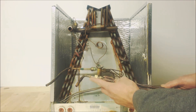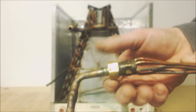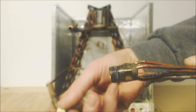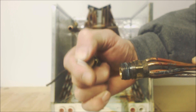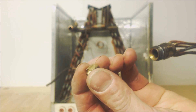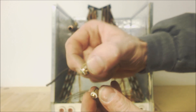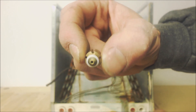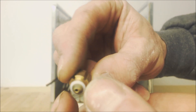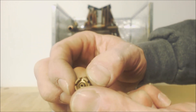Most manufacturers have stopped supplying the piston with the outdoor unit. Here we have a piston chamber instead of a TXV. Inside you have your piston or orifice. There's a nut you can take off and a seal. The piston is sized according to the outdoor unit. Here are some of the newer ones — there's a little seal on the side. In AC mode it seals against the front; in heat pump mode it moves back and flows refrigerant around the piston.